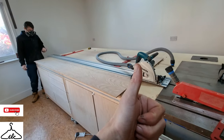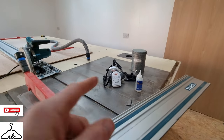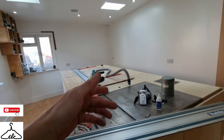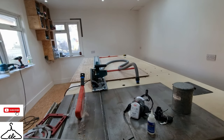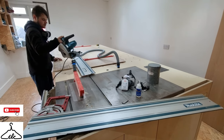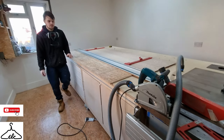There we go — quick fix, should only take you 10 minutes. Use a thin oil; the WD-40 was just to clean out the hole first. You can also service your machine at the same time by blowing out all the dust. Once you've oiled it, do the grub screw up and move the saw up and down a few times — you might have to repeat the process if it hasn't freed up first time. Grease is too thick for this pin, so go with a thin oil. Ten minutes' work and your saw should be back to normal.